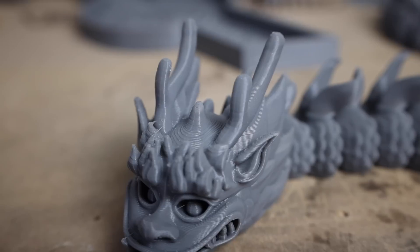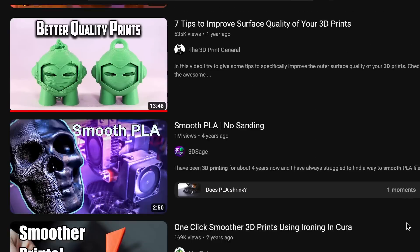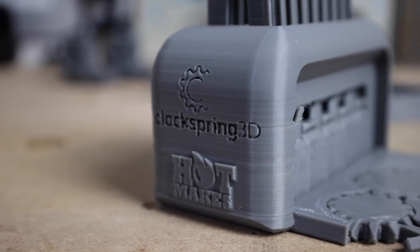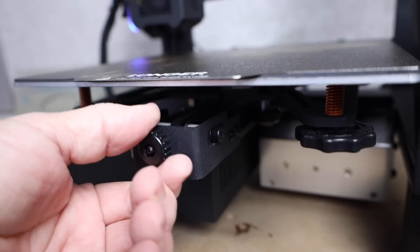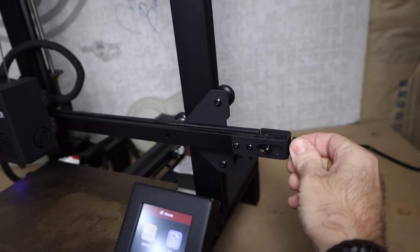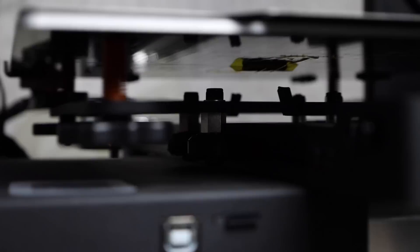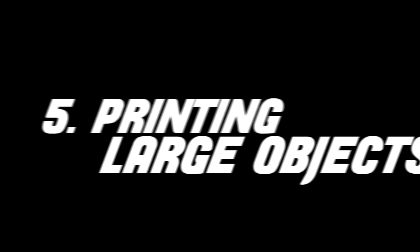If you take a closer look at 3D prints you'll see thousands of little ridges — that's each layer stacked on top of the other, it's just the nature of the beast. The ridges should be fairly consistent with no bulges like I had on my first print. A couple of simple things you can do: the Longer LK4 has simple belt tensioners — tighten the belts on your X and Y axes, obviously not too tight. Also tighten the rollers on the arm, under the bed, and behind the extruder head. This will tighten things up and give you a much more consistent print.